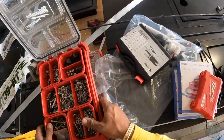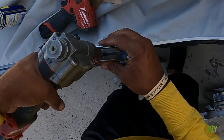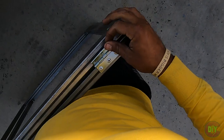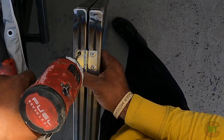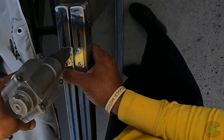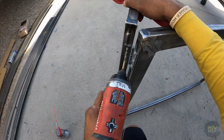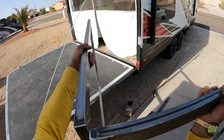We also got some door hinges from the hardware store and we're going to use those to join everything together. We'll put rivets in — they're flat enough that if you do all three on each end and they butt up together, it should close without binding. These are standard aluminum rivets; you can get stainless steel rivets which are much stronger and we'll probably use those in some spots as well. The structure itself is folding out well.